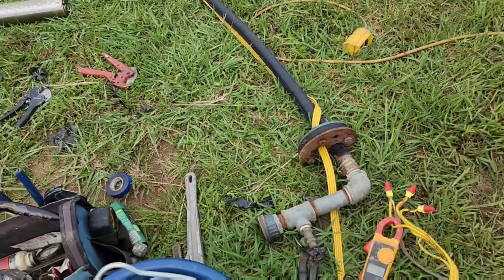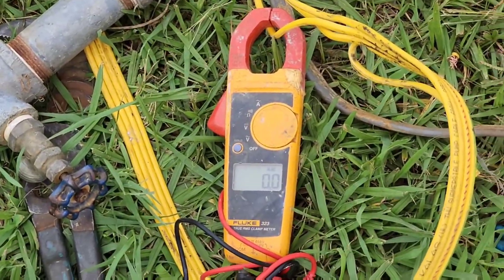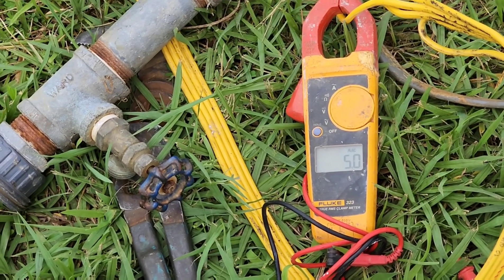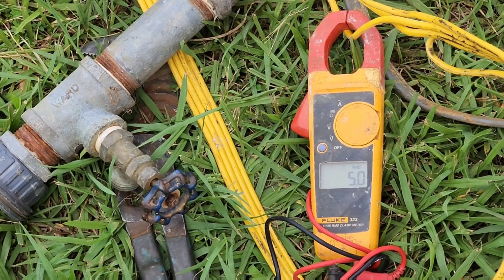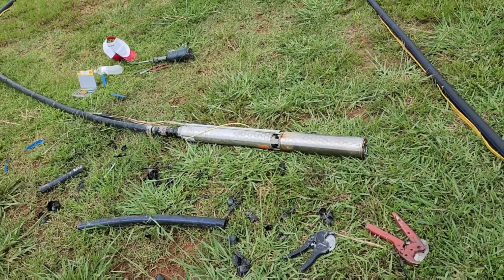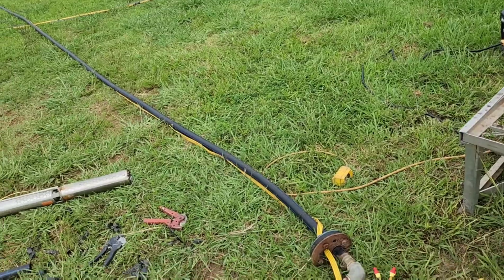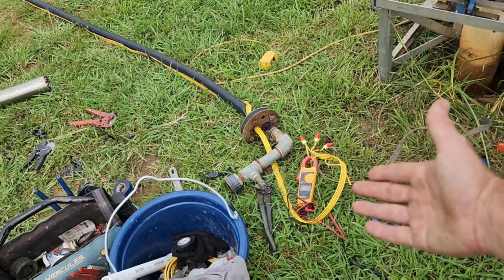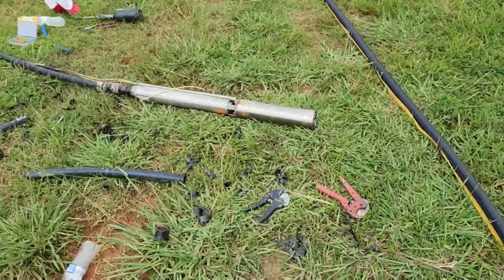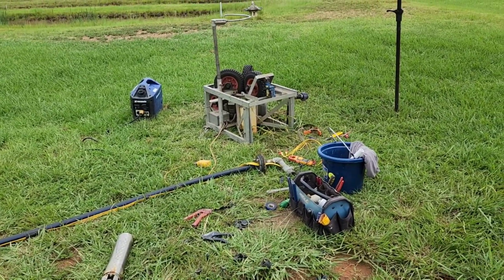It's got these sweat bees out here. That's good — perfect. So it was just a bad wire. If you ever want to test your well pump to see if it's good, you can always run it on top of the ground just like this. You just need a clamp style amp meter — you clamp it around one leg and then you read it. All right, we're going to go ahead and slam this thing back in the hole.